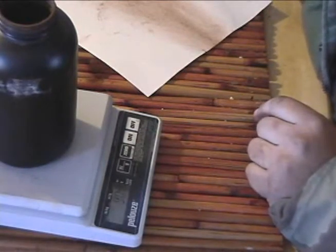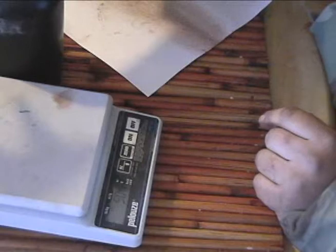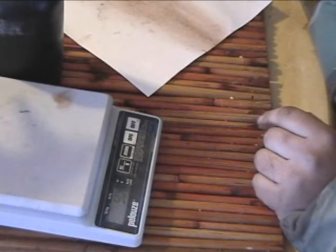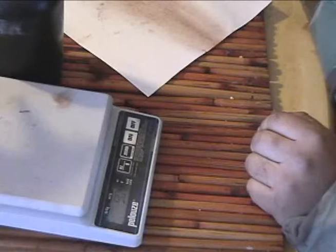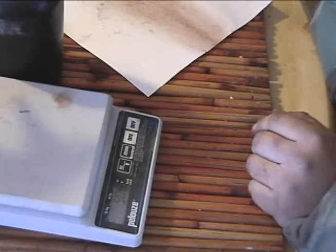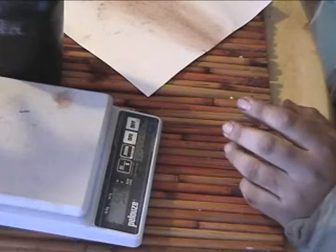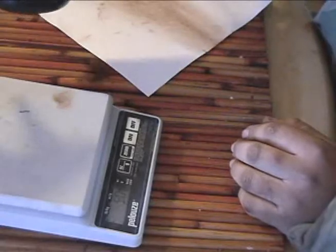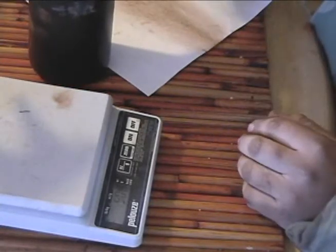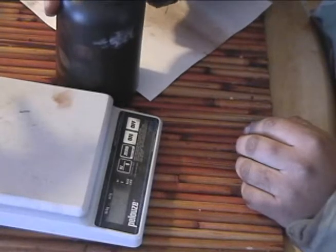For those of you who are wondering, we ended up with 90 grams of iron oxide. How much you get would all depend on how much amperage you're using and how long the duration. If I left it until both bars fully dissolved — the two bars are about a pound each — so theoretically I should be able to get about a pound each of iron oxide. I believe it is a one-to-one ratio. As you can see, the volume of the oxide is an awful lot more than the original iron itself. Alright, that concludes how to make the iron oxide — now we'll get on to some other stuff.